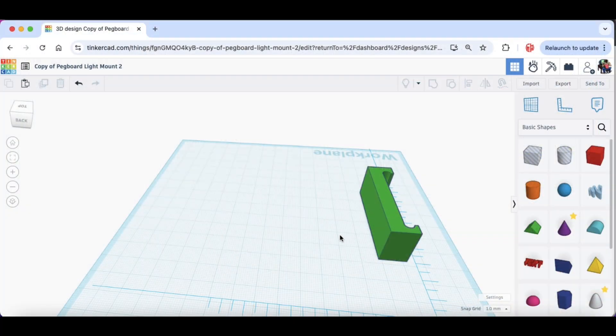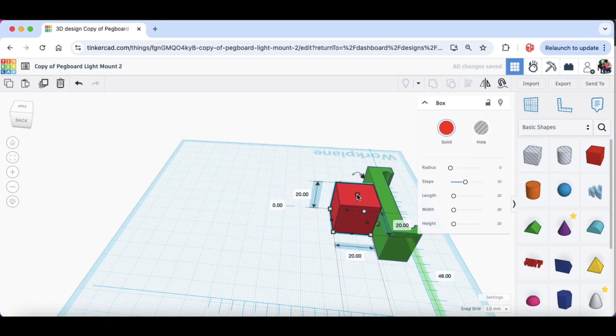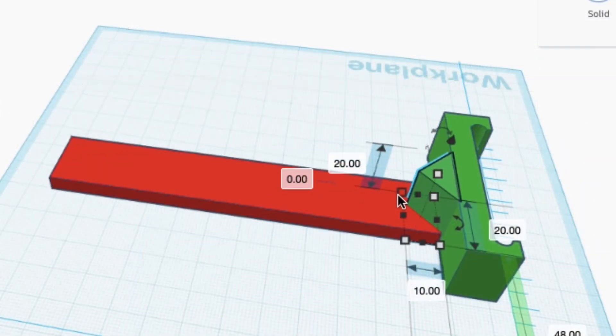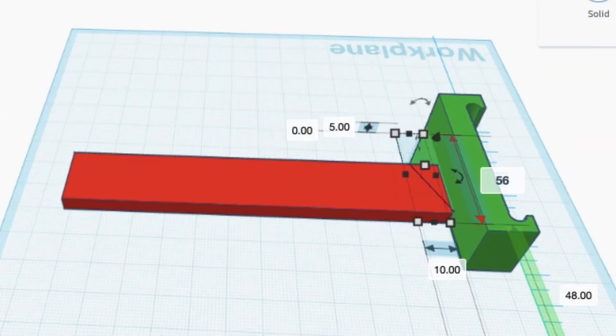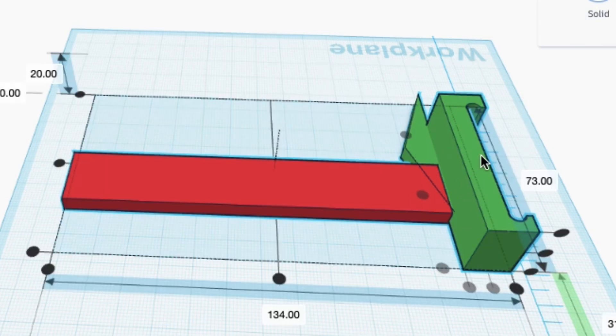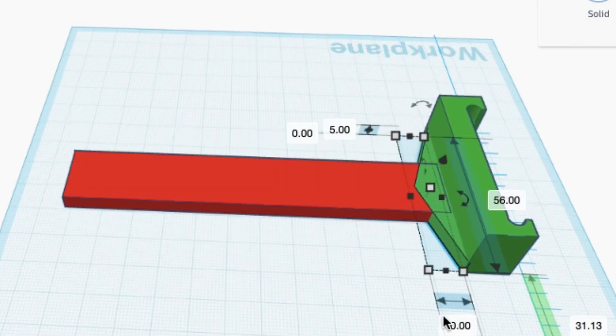For this new workbench I just needed the snap portion, so I'm going to remix it and put a different mounting on it. What I need is a long arm so this can hang down from the rafters of the basement. I added a block and stretched it out to 120 millimeters, which I took a measurement of — it was approximate. I also wanted this to fit on a small printer, an A1 Mini. Then I added a triangular bracket which I had to resize and reposition, and centered it to give it a little side-by-side strength.